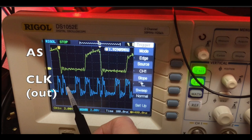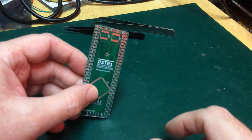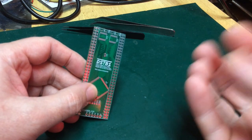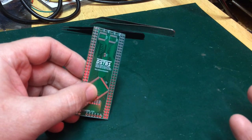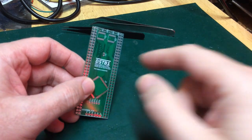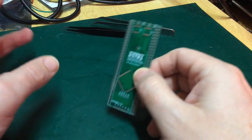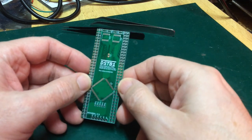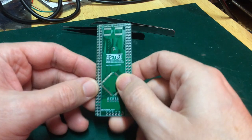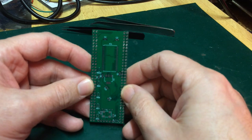and that worked. It was fine, but what we saw was you really didn't get very much benefit at all, sort of the order of 10-12%, because all the access to everything else on the board is still occurring at 8 megahertz. That's memory, that's peripherals, and the important thing with the 68000, it doesn't have a cache. So in effect, it's everything. So you really don't see much, unless it's doing some intensive numerical calculations that don't require access to memory, which is not many. So I thought I'd knock together a little board, and that's what this is. And it's going to try and address some of those problems.